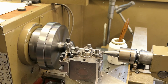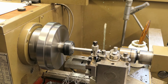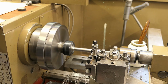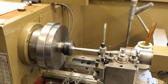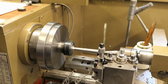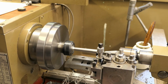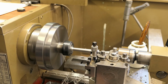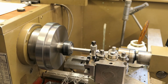So back it off. Go well past the end. Take out the backlash. Next one, bring the cut in. Now I made a mistake then, I backed off. So come in, nope. It's important to get this backlash out properly, so come all the way back. And then just to where we're going to start the cut. About there.